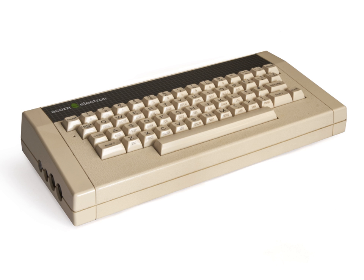The PRES Advanced Plus 5 provided user port, 1 MHz bus, and 2 MHz bus capability, enabling second processor usage. The user port is usually implemented via a 6522 VIA chip.